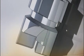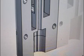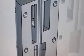New to the design is the bit and bottom hole assembly we will construct. Previous teams have shown more success with a two blade cutter, so our design will be a two blade that is shortened from previous years. The design may need to have undercut added if directionality is not achieved. The bit will attach to the drill string using a coupling. The bottom hole assembly will be a non-rotating sleeve that allows the drill string to turn freely inside. The BHA will have space for a sensor within it to measure accelerations, azimuth, and inclination.